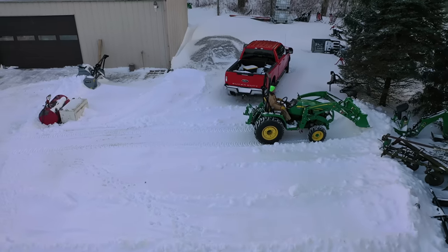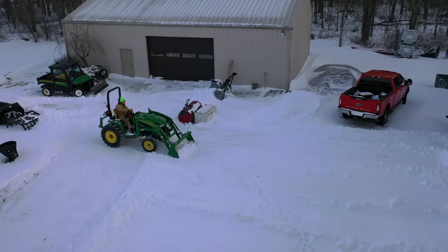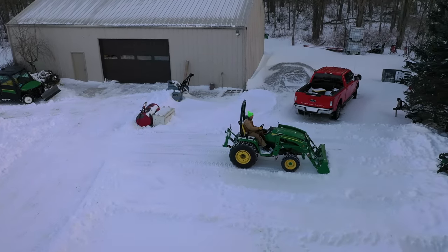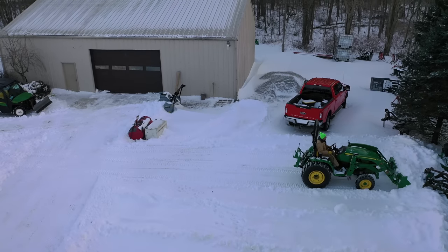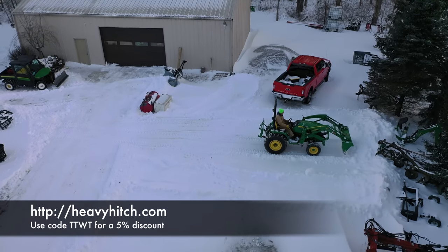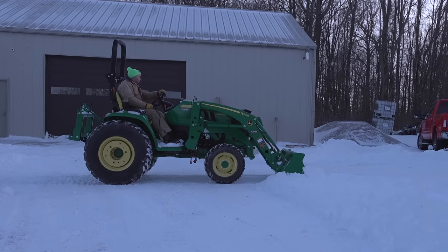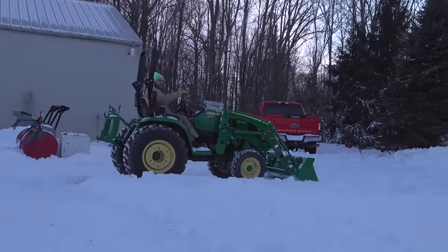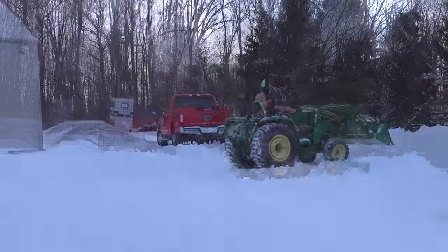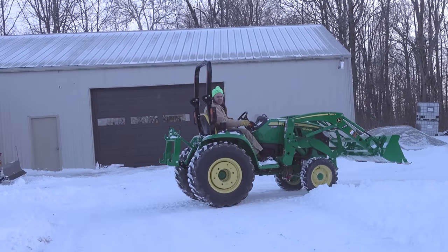You might also be thinking about a rear three-point ballast — I probably could use some. But remember, I have a full rim guard in those large back tires, and I also have three 50-pound weights on each side, so I've got a good bit of rear ballast as it is. Probably just a little bit of laziness kept me from putting the heavy hitch on. I'm running in the float position now just to try that — it's working really well, actually. The edge tamers have enough force to keep it from digging in, and the float position allows me to steer better. I don't have to try to control the height manually.